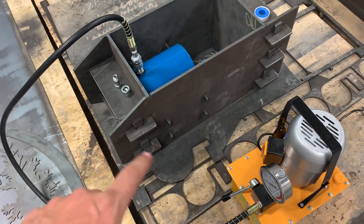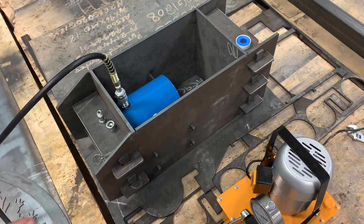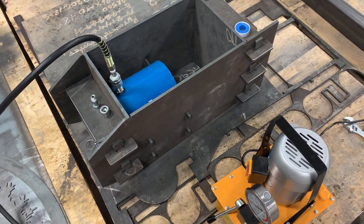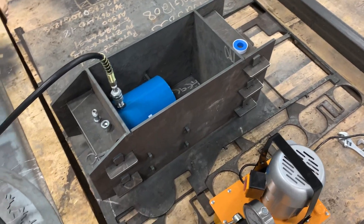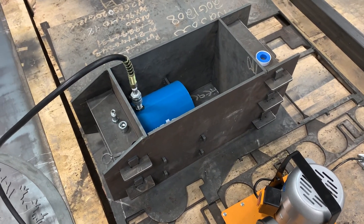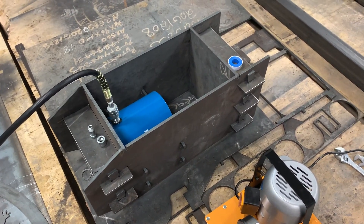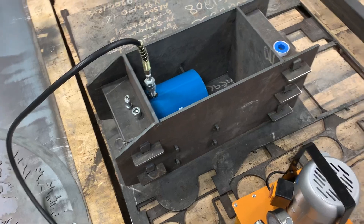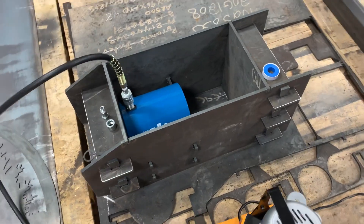The reason we didn't weld this frame together is two parts. One, we wanted to be able to break it down — pull all the pins, break it down, throw it in the truck without having to haul this whole thing around assembled. Second, we made this out of three-eighths inch thick AR500 hardened tempered steel, and the problem with that stuff is if you start welding on it, you can get some pretty bad failure points with the welds. It's a brittle steel, so it's difficult to weld to. For something like this that might be flexing a little bit, we didn't really want to risk that. We came up with this design so it can be taken apart relatively easily, and it actually worked out pretty well for us.